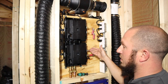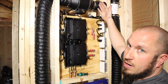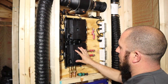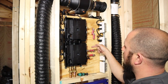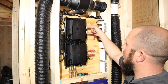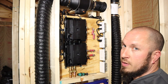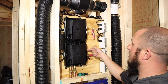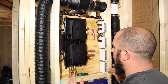You're looking at a 1, 2, 3, 4-port system. If you were to get a six-port, it would be double the height. Each of these has a zone — your hot and cold come in, and then each zone can be thermostatically controlled. Whatever you hook up to the bottom two outlets can be the same temperature, and whatever you have hooked up to the top two ports can have a different temperature — so zone one, zone two. You can't have a different temperature within the same zone, but you can between zones.